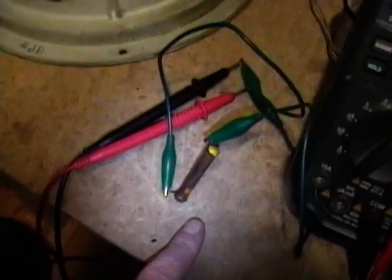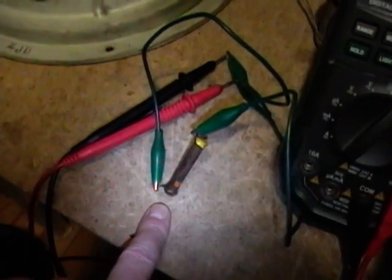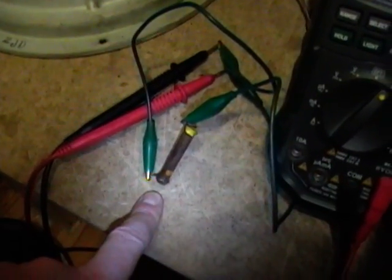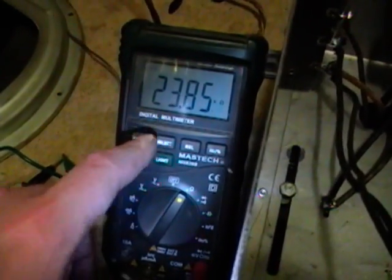It was tough to get at, but I finally managed to get a new capacitor down in there. Then I went over and checked the last few original resistors that were still in the set, including this dog bone, which checked pretty close to being the correct value of 14K when I checked it initially, but now it's measuring about 24K.